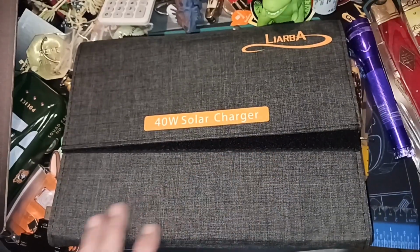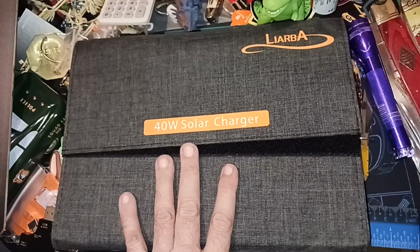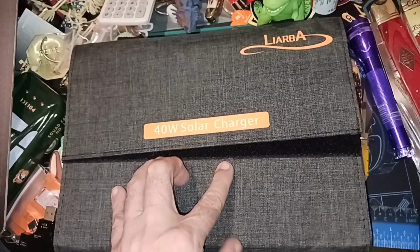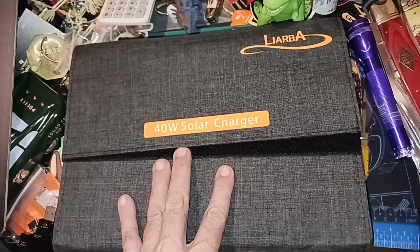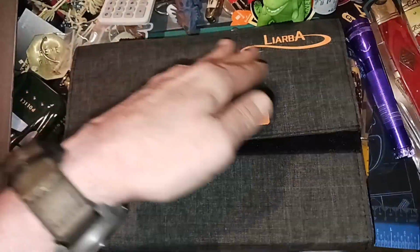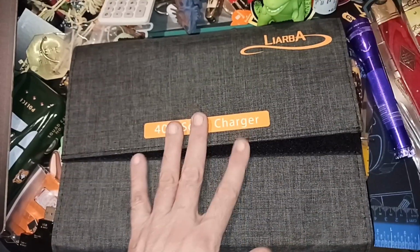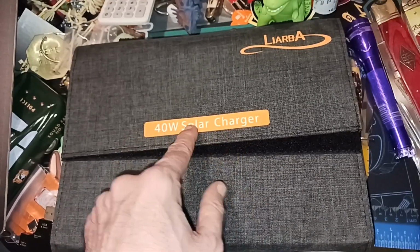And what you have to do when you're building a solar system is first take into account how much sunlight you get, depending on where you're at and latitude and everything else. I'm in Texas, we get a lot of sunlight, but because I'm in a courtyard, the way my balcony is facing, I don't get really direct sunlight until past noon usually, and only a little small section gets light. So already I've limited the amount of time that I can charge something, depending on how well these work in less than direct sunlight, because all of these are usually rated at direct sunlight.